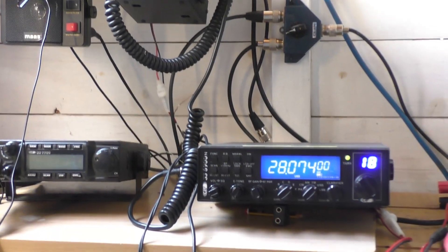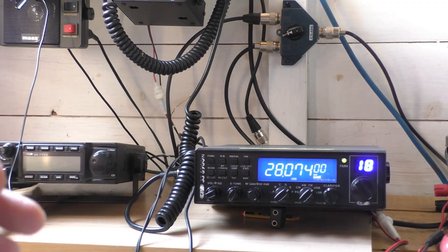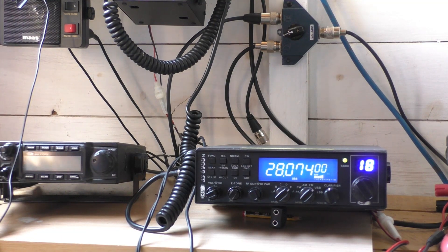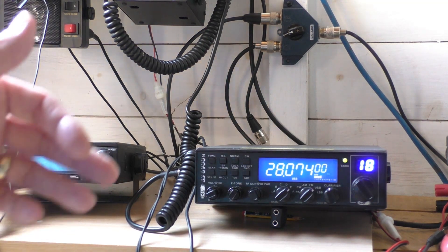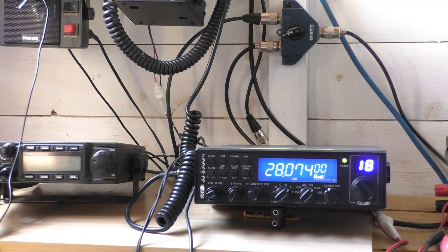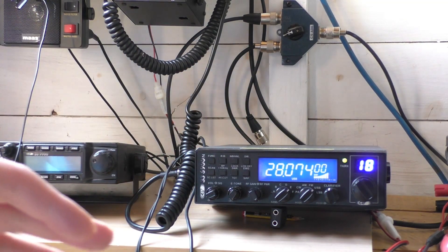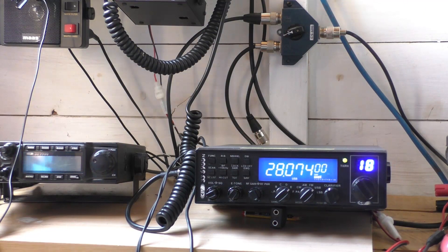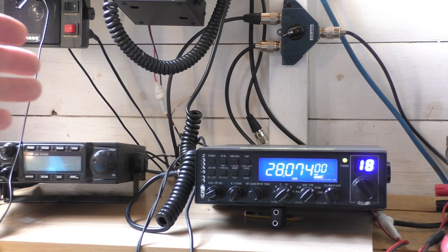Finally, people said that I was putting the input in too high — I was up to about 80 or 90 dB, and the sweet spot according to everyone is around 50 to 60 dB, not to go above that. As long as the volume is loud enough that it's hitting 50 or 60 dB and I've got the time synced on the computer with the software, in theory it should work — because I'm only trying to receive, I'm not trying to transmit.